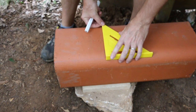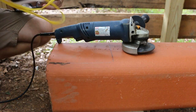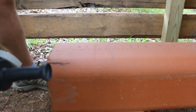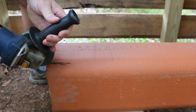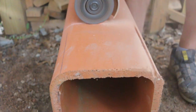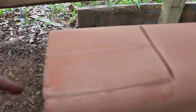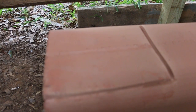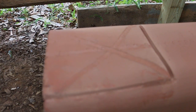Check this for square. This process is going to make a lot of dust that I don't want to be breathing, so I'm going to wear a dust mask and some eye protection. I'm using a masonry blade — I started out trying with a metal cutting blade and it just made it mad. So I've got this thing pretty deeply scored, and what I'm going to try instead of cutting all the way through is putting a seam down the middle and seeing if I can just break it out carefully with a hammer. I might end up cracking the whole thing, but I'm hopeful that the deep cuts will let it break cleanly. I may do an X here just to give it some weak points to crack in.